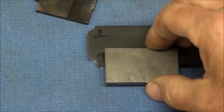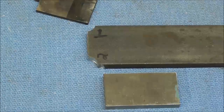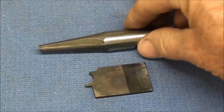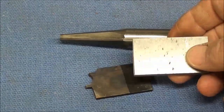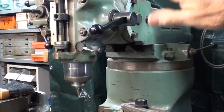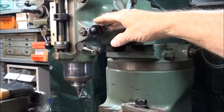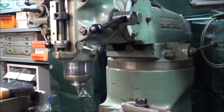I'm going to harden and temper it, but I'll do the heat treating off camera — I've shown a bit of that and in the future I'll cover hardening, tempering, and other forms of heat treating extensively. Be sure to go back and look at that video on making the oil dauber, because when I made that form tool I used a taper end mill. Many of you won't have taper end mills, so I'm going to show you how to do this without one — we'll do it in the milling machine, basically cutting a compound angle. You can tilt the Bridgeport head, but you'd have to tilt it in two directions, and many home shop machinists would rather take a beating than tilt the head and tram it back in. So this is the way to do it without that aggravation.